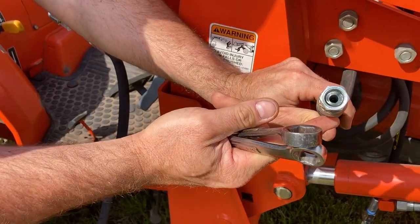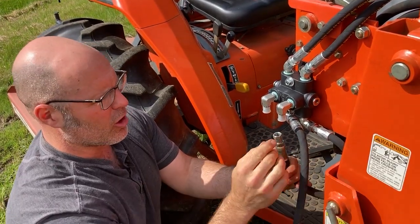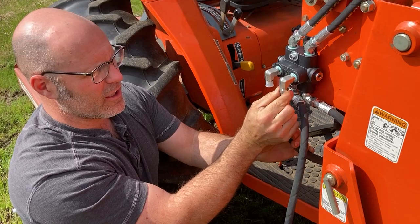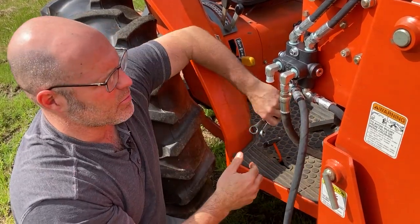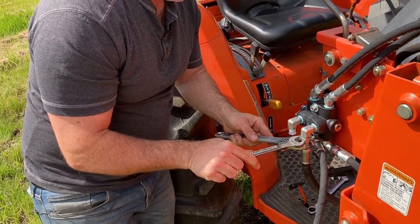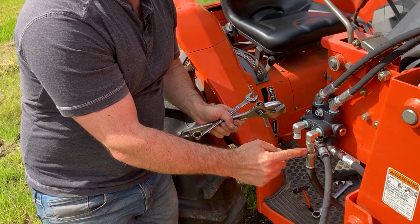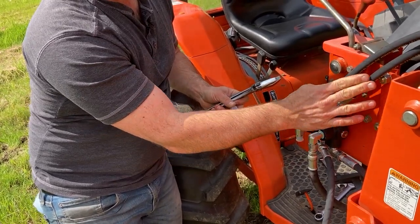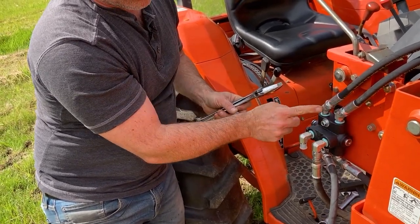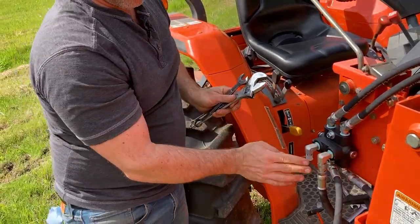Here's my white hose that originally went to the connection on the loader arm. This white hose that's disconnected from the loader arm is going to connect right here to this threaded fitting. With the swivel fitting, they seal up internally, so we don't need thread seal tape and you don't need to crank these really tight — just a little bit of wrist strength, but do not put your whole arm into it. White hose is connected. That means the front set of fittings is going to be our white, and the rear set of fittings is going to be our yellow. Let's go ahead and get the yellow off of the loader arm and bring it back to this port.